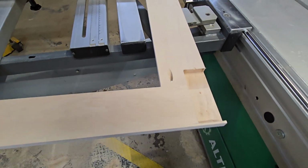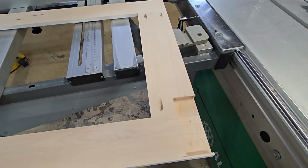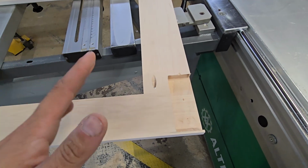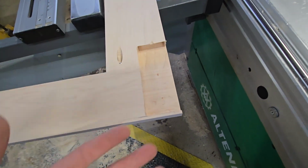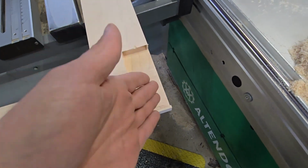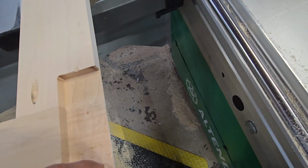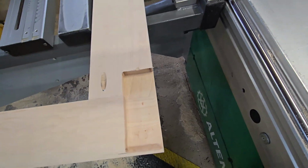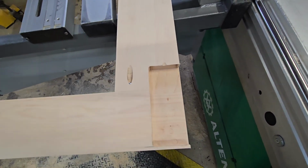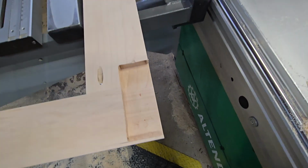So just to put it in perspective, right? You sell the appliance, you tell the cabinet guy, oh, put the door on. It's just simple. You just put the door on, right? I couldn't even do it on a CNC machine because I can't even hold it down properly. This is going to explode if I did that. So I've got to go real easy, 1/8 of an inch at a time, so this end grain doesn't literally explode. So that's like an hour worth of my time, right? Plus making sure and fitting it. And then I've got to still put it on.